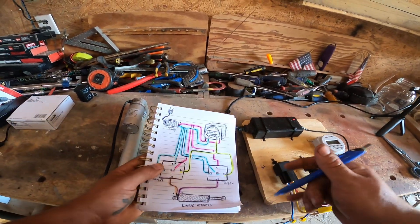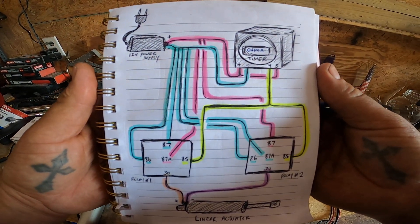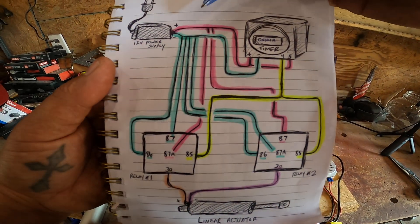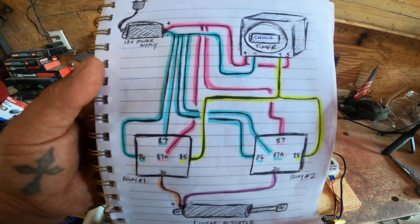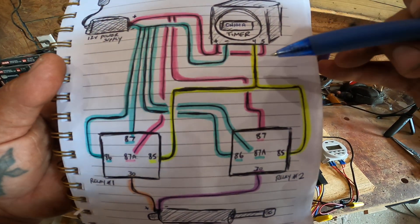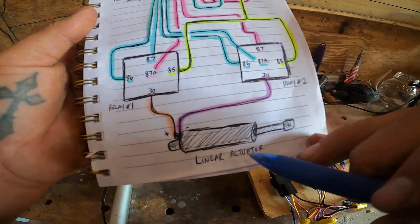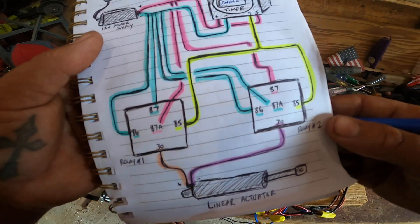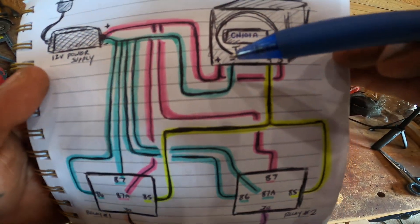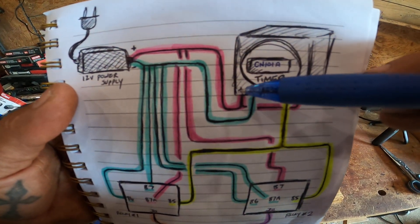To get straight to it, I've got a wiring diagram here. I'll put it in the camera the best I can so you can pause and work from there. I'll go over it quickly. The pink wiring shows the positive lines off of the power supply. Blue is negative. Yellow is the triggered positive out of the timer. Purple and orange show the linear actuator wires. The positive wire out of the power supply runs over to the positive channel on the timer.